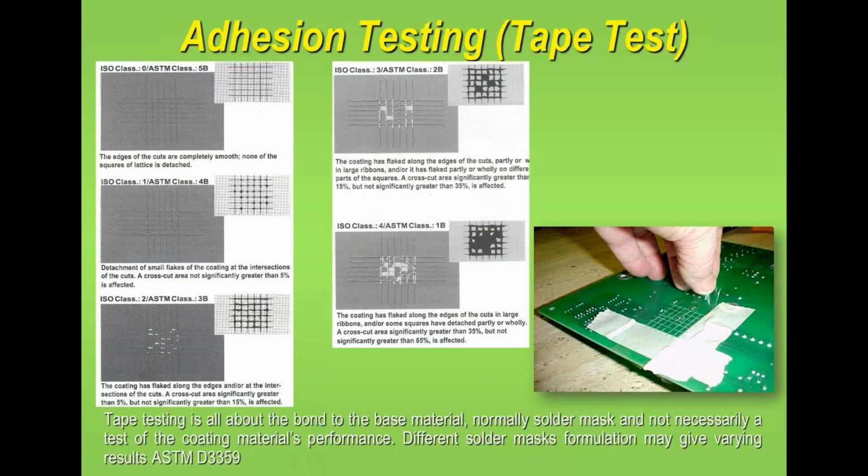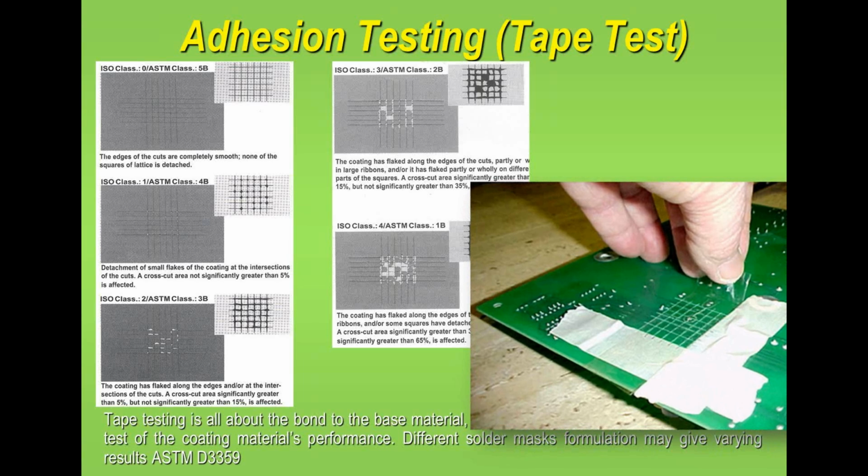Now, it's fairly uncommon to have solder mask lifting from the printed circuit board today. Clearly there is something wrong if resist lifts, in all honesty. But the peel test is used when you're conformally coating a board with resist on, or you're testing the adhesion of the mask to the board. This is a fairly simple test which you can conduct yourself. Basically, you're measuring a distance, and the tape I show in the photograph here, which I'm just blowing up ever so slightly, has got marks on.